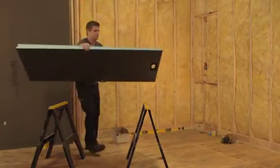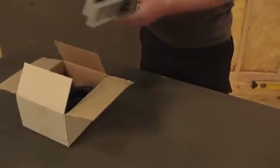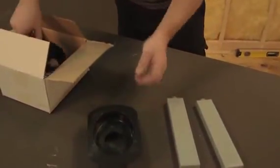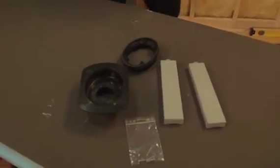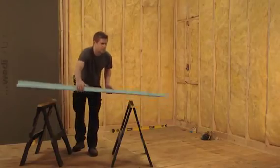The WEDI shower system Fundo Rialito with integrated linear drain can be used to safely install custom or standard shower sizes. The Rialito bases are available with a traditional one-way slope design, as shown in our video, or as a four-way slope design with level perimeter for easy recessing into subfloor constructions for floor-level installations.